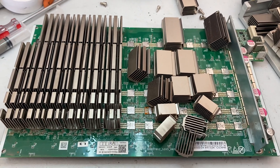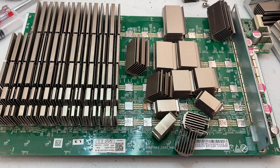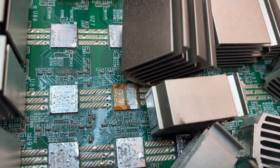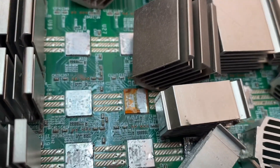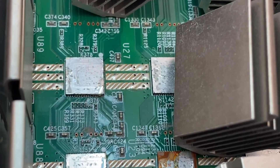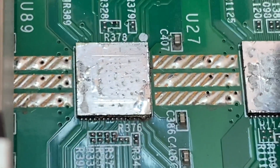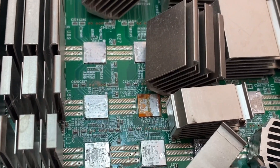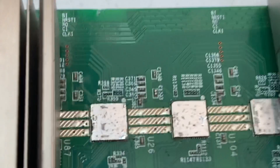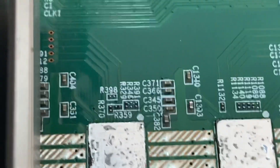Do you want to know what happens when you get tired of fixing the same S17 Plus board over and over again? You can see that's one that obviously got hot, and this board I don't think I've ever touched before. At this point I am going to tear apart every single board. Look at that terrible soldering on top of that chip — all those pins are shorted. I am going to possibly offer a service where I go through, remove every single heat sink, and clean up all the problems on the board. You see all this solder just floating around on the board? Disgusting!